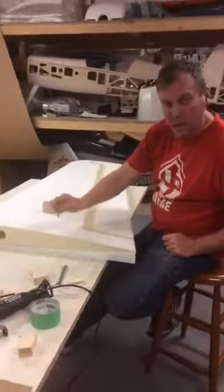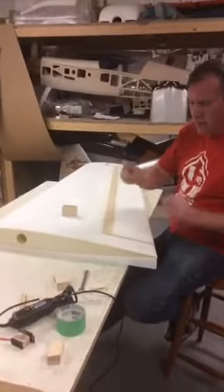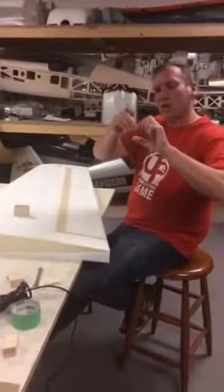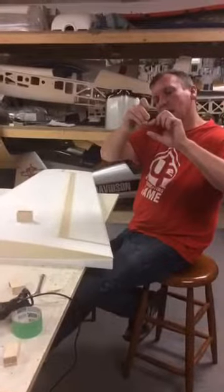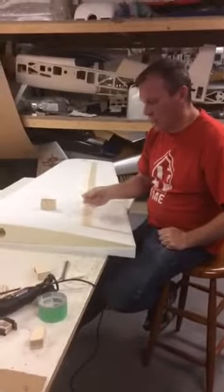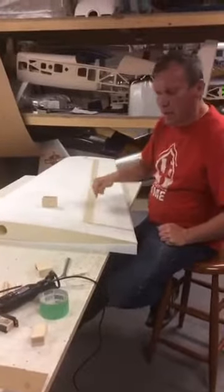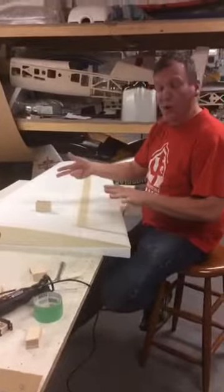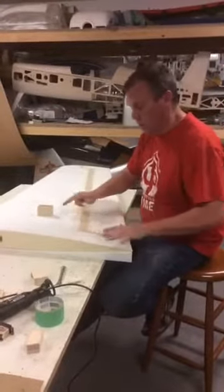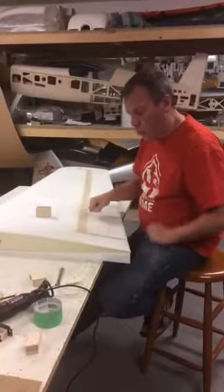Then I reset it, and I drop it down further. I do that consecutively two to three times. So if you take a box this big by 1/4 inch, you're going to get 3 wires through it quite easily. Now, you have this great big channel cut in there, and if we were using Gorilla Glue like the old method, the Gorilla Glue is going to find that channel and it's going to fill your wire line.